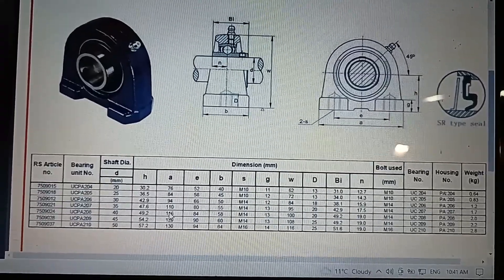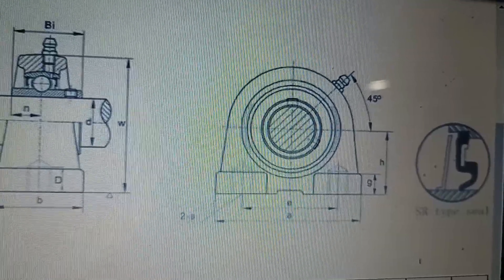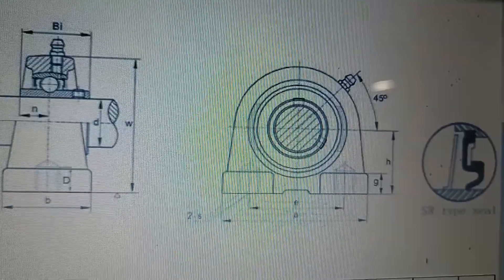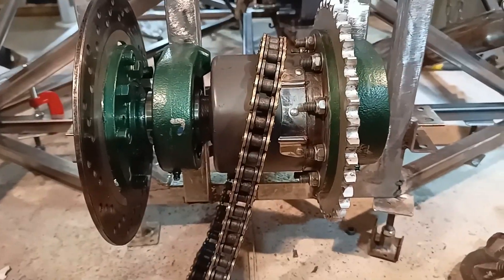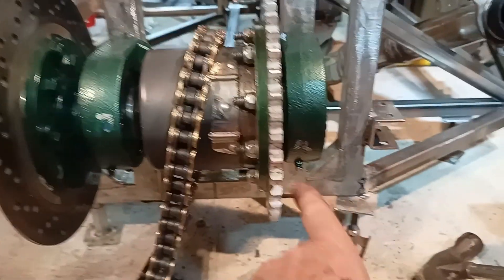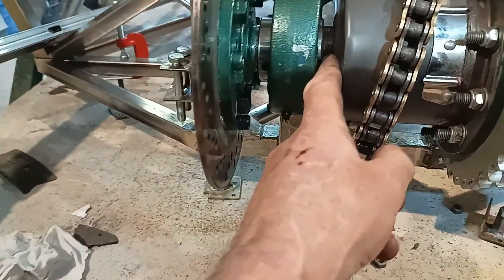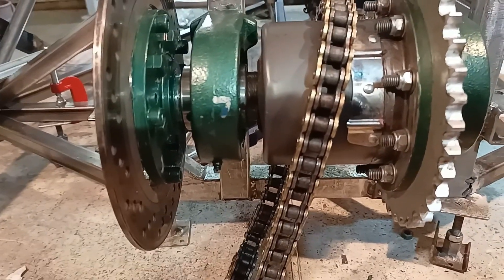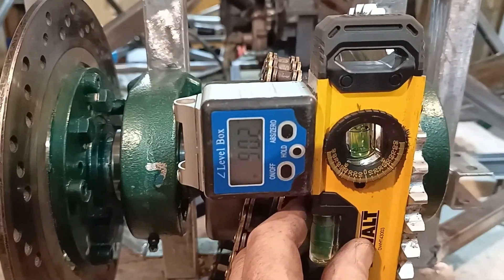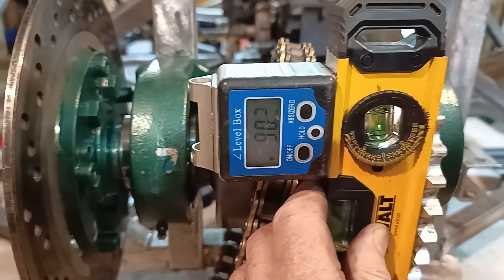The drawing doesn't show any offset in how the tapped holes are drilled, but I'll bet my back teeth that because this is a cheap import, the quality process and the manufacturing has missed a trick. I've fixed that by flipping this one over so that it's got the same hand as the one on this side. It does mean the bearing has moved out that way slightly, so it's got slightly less purchase on the shaft, but short of rebuilding it, that's how it has to be. The sprocket is now vertical, within 0.2 of a degree or a millimeter of it, which I can take out through adjustment in the bolts. I'm quite happy with that — move on to the next problem.